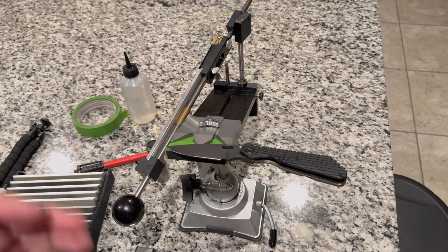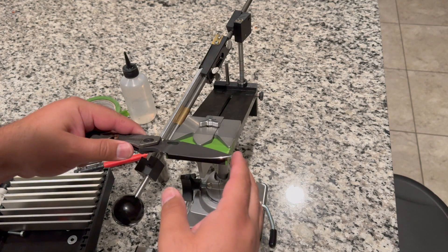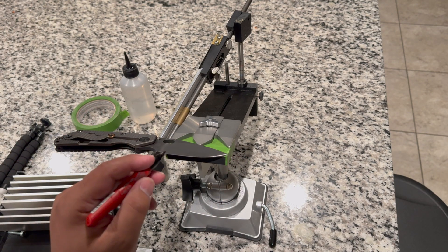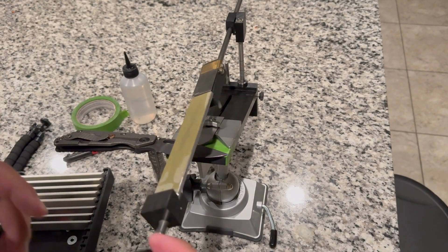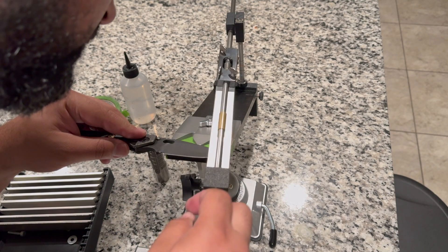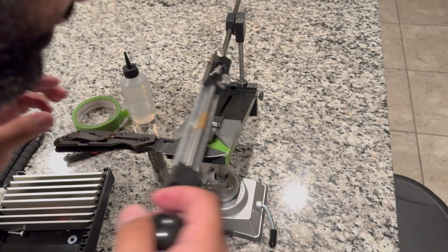Normally on a clamped guided system, unless it was a full flat grind, I probably wouldn't check the other side. But the Edge Pro has a way of showing you that your edge bevels are uneven and that your primary grind bevels aren't even either. It tells you if something's wrong with your knife from the factory — if it's ground poorly — but at the same time it makes it more of a hassle to fix. We'll take a look and see — and that removes perfectly as well.